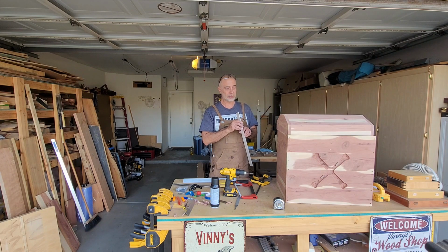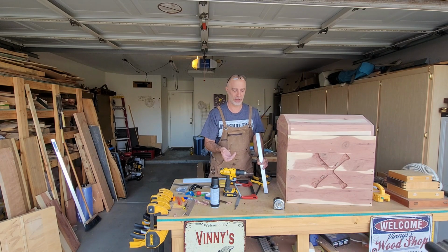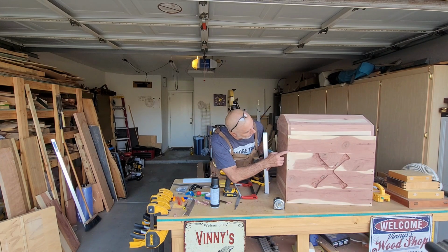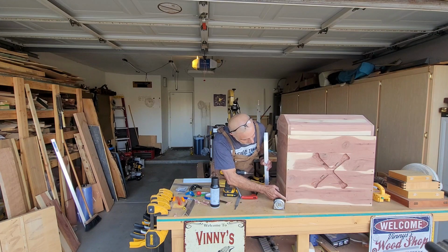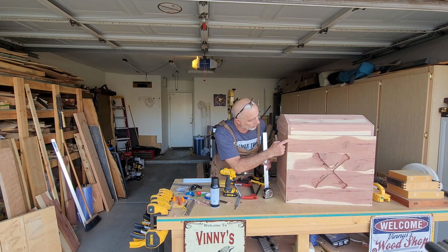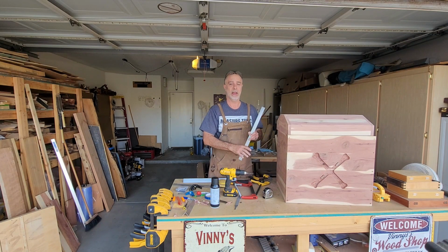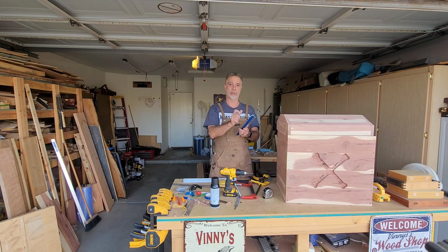But what I've done now is I decided that I wanted to put in 4 studs, or 4 of these nails. So if you look, I went ahead and put these dark dots right here. And for me, if you're going to follow what I'm doing, it's 1.5 inches up, 1.5 inches down, and then from these 5 5/8, 5 5/8. And then I transferred that to this.